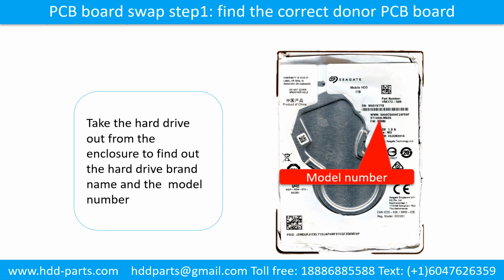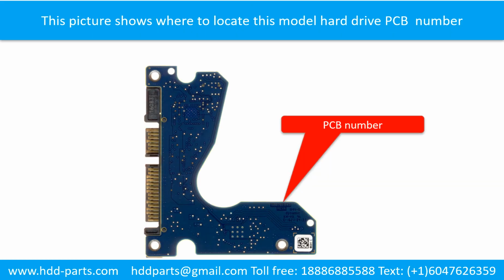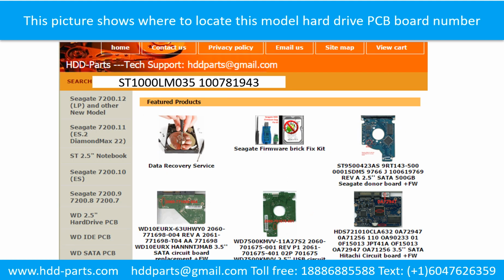Locate the hard drive model number on the front of the hard drive label. Locate the hard drive PCB board number. Different brand name, different PCB board. The PCB board numbers are different. You may go to hddparts.com to check out other brand name PCB board numbers. We use the hard drive model number, PCB board number, PCB board sticker number and CPU number as reference to search for the donor PCB board.